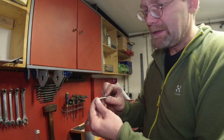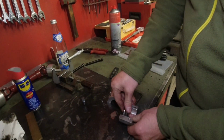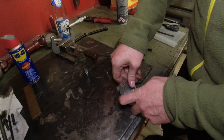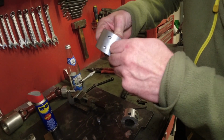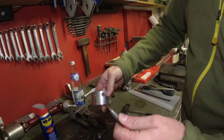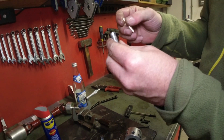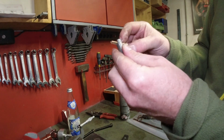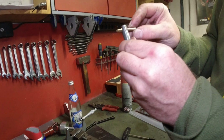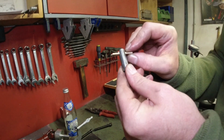But it doesn't matter. When I now want to machine the pusher, there is a little trick you need to do. Pusher is quite tight. It's good. Everything is a good fit. It's kind of important that nothing is loose. So this is the pusher. And what you need to do is machine that slot in the same width as the pin. And of course, so that it has 90 degree when the 2 pieces are mating.